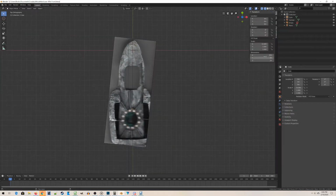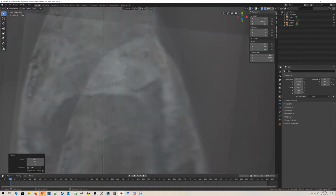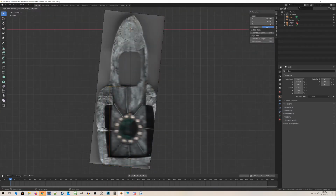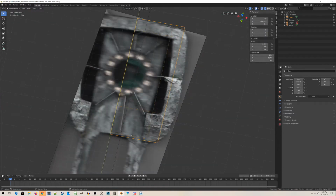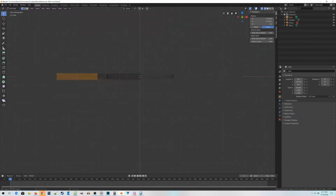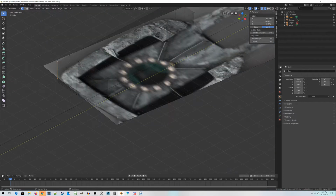In order to turn the front of the laser rifle into a 3D print, I had to first perform a crazy balancing act to scan the piece, which was still attached to the rifle, and also I had to kind of lean over to get it to my scanner and just use my computer at the same time. It was a mess. Importing the piece into Blender, I scaled it using a known reference, which was the bottom support rod. Its diameter was just under 32 millimeters.